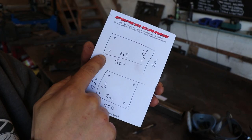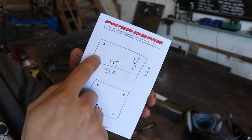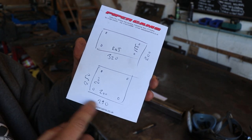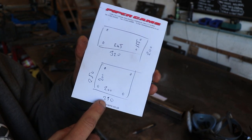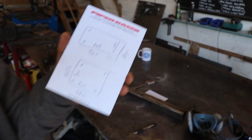The top plate is 200 by 320, and this is the bolt pattern spacing. The bottom plate which bolts to the floor is going to be 250 by 250. I'm going to cut all of this out of six mil plate.